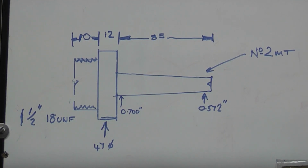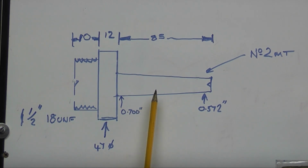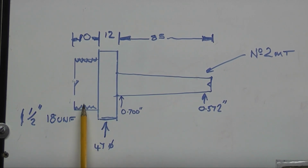This is what I want to make today. It's going to be made from some mild steel bar. We have a number 2 Morse taper on this end and a 1.5 18 UNF thread on this end, and it holds my boring head